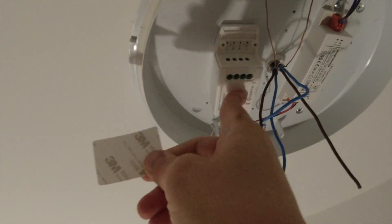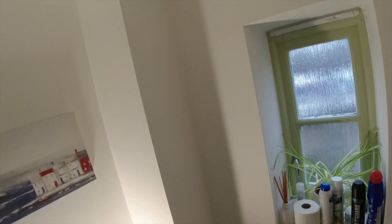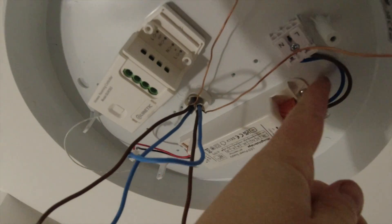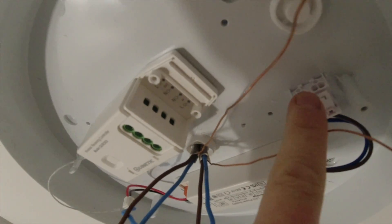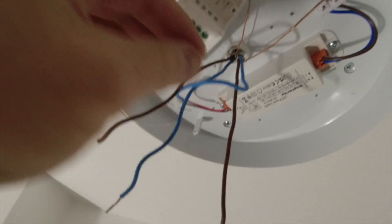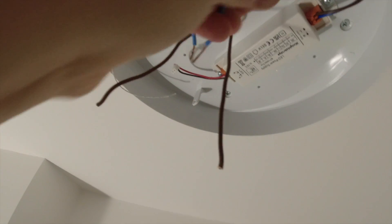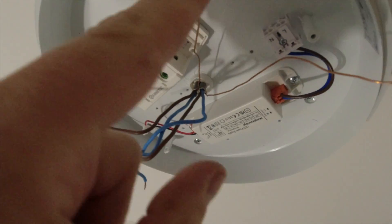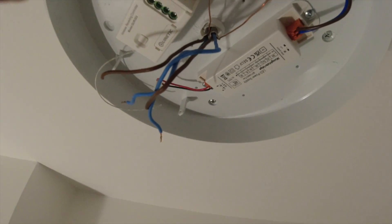What you can do is fix these in - there's a little screw hole at the back there. All I've done is take off the sticky and it sits in there nicely. All you've got on here is a live in, a neutral in, a neutral out, and a live out. Essentially those two will extend the cable to the live out and the neutral out, and then these two - neutral in, live in - will go into their connections. Single insulation is fine because it's contained in this light fitting, only accessible via a screwdriver.